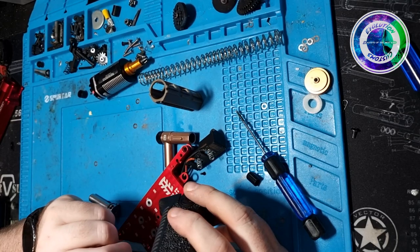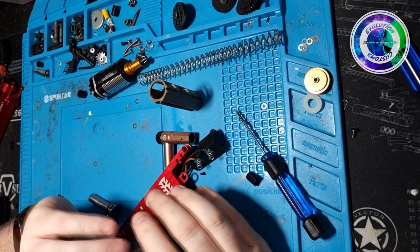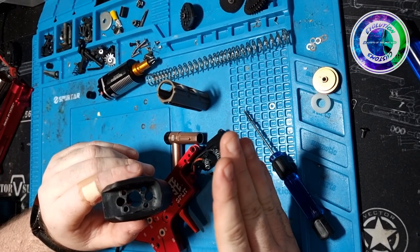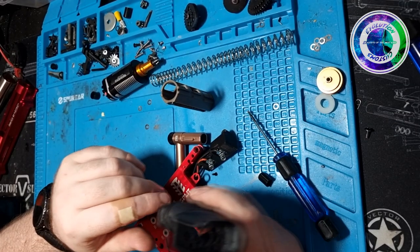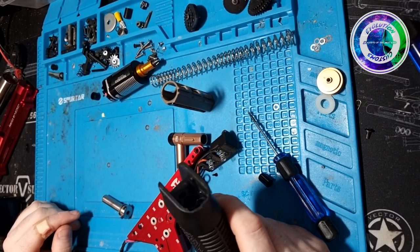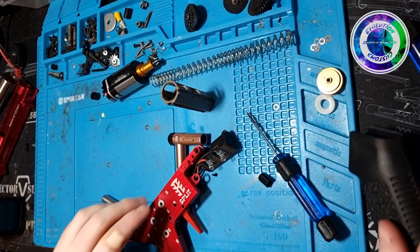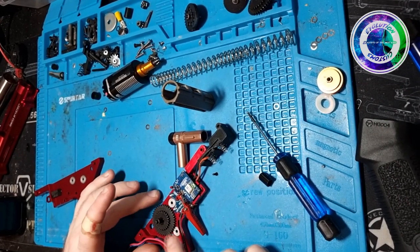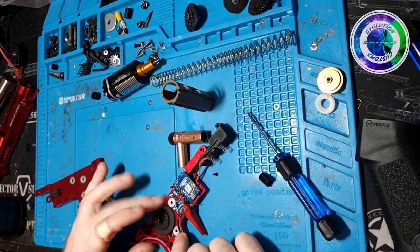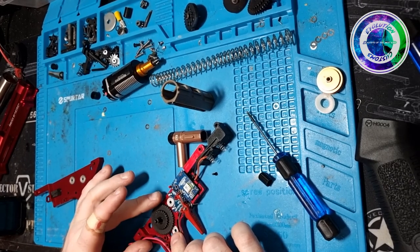Another thing is the hole here for the motor shaft. I just very lightly run a radiusing bit around the hole to make sure the motor shaft isn't being pushed on a certain angle — every motor is different, you're going to have to play each one by feel and by eye. I leave that 0.1mm of movement on each gear. Put your gear in — good gears won't wobble around in good bushings. You should be able to spin it and see that there is no gear wobble — it's literally just spinning beautifully.